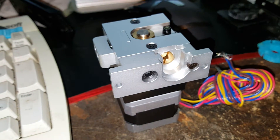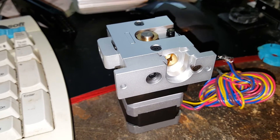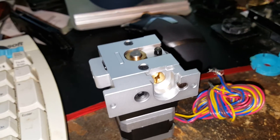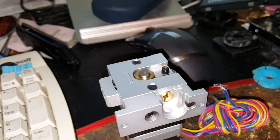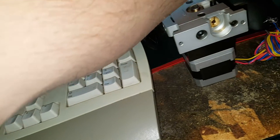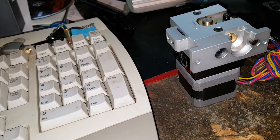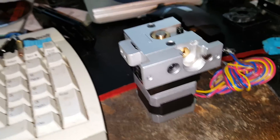I will get this hooked up and get back to you with more on this. My Pegasus printer has been printing flawlessly. I've made a couple of little changes on it, but I've found that if you keep the room temperature between 66 and 72 degrees using Full Spectrum Laser's resin, it seems to print flawlessly no matter what I print. I also printed out a gearbox for making my own NEMA gearbox, and it does print well — I cannot complain. With the newest software, I've been able to use some resins from other makers that I couldn't use before. Thank you for watching — I'll get back to you and let you know how this works.